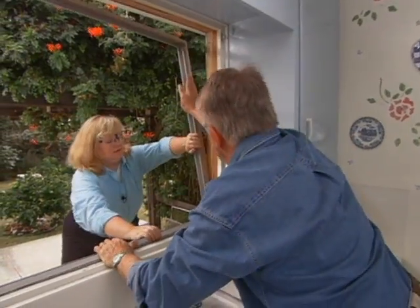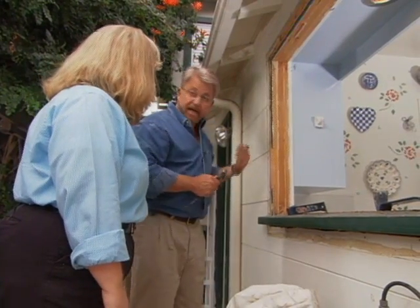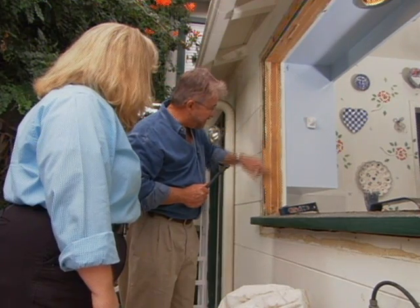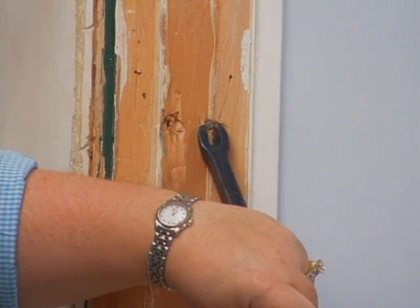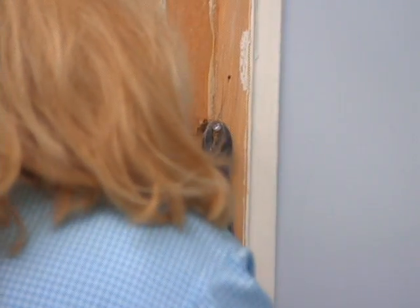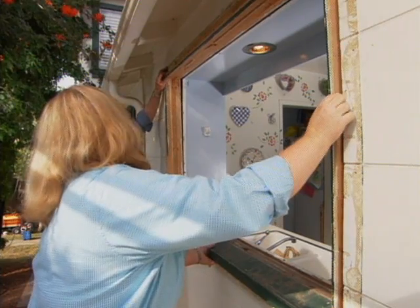What's left is the original wooden window frame. It has to come out for the new window we're putting in today. It's held in place by nails — pairs of them all the way around. I show Jenny how to use a nail remover: drive the dual prongs up under the nail head with a hammer, push down the handle to pull the nail out, then flip it over and rock it free.